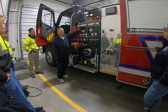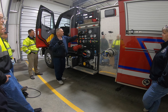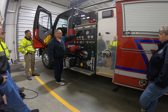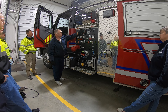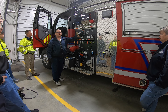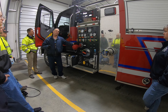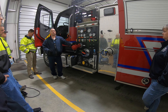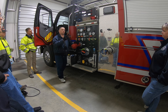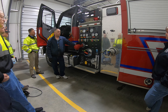This is your standard throttle — this just has engine controls, temperatures, and whatnot on it. I have not put any presets on it; you can scroll up and down on certain things here, but this will generally bring up your RPMs. It only goes up to about 1450 RPMs on the truck and that's it — you're pumping a thousand gallons, probably a little bit more. I have not tested it to see what the flow is out of everything lit up, but it pumps really well. We had all the hoses out with some discharges open and it was really handling it well — that was sucking it from the pond up the road here, and also using it out of the tank.